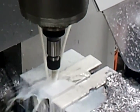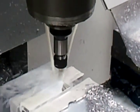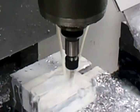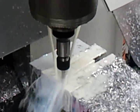So this one is going to just go to the outside edge first. What we're going to do is clean the outside up and profile it and make the shape. Then it will switch and it will drill the holes — actually it will spot drill the hole locations first, and then it will come back with the drill and drill the holes. Then it'll go through it in the middle of the slot.